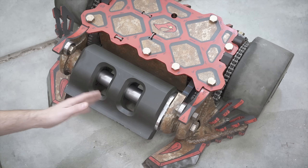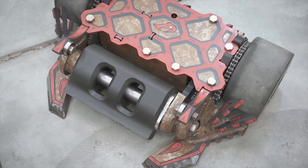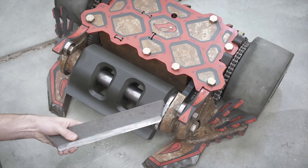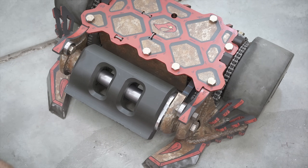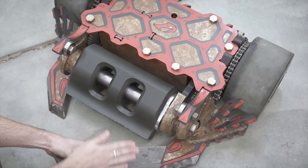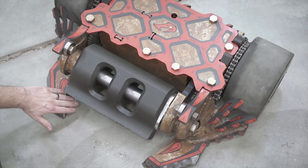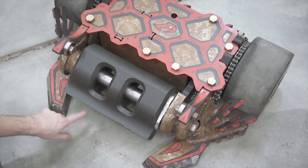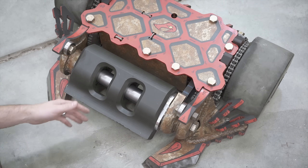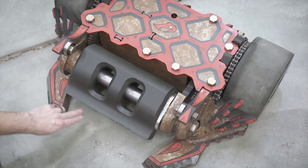Speaking of that Kronos fight, the shell came along and hit the inside of one of the forks and actually bent that whole side out. We have a solution for that this year, which is this huge bar made of AR-500. It would get welded in between the forks, which effectively ties the forks together, gives a little bit of a ramp up front so that weapons can hit off of it and won't catch the inside of the forks, and creates a huge structural integrity between the two forks. We're not going to do this right now because once it's welded in place the bot cannot come apart anymore. We're going to do that as a last-ditch effort if we face someone like Kronos again, Tombstone — any big high-powered horizontal — we'll tie these forks permanently together.